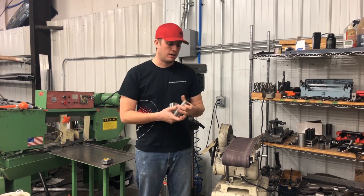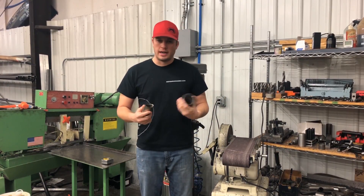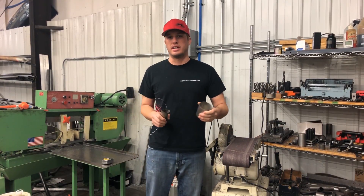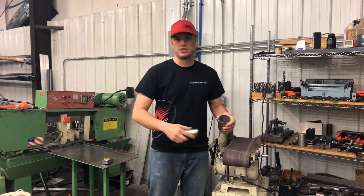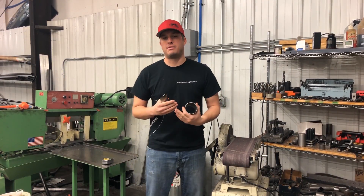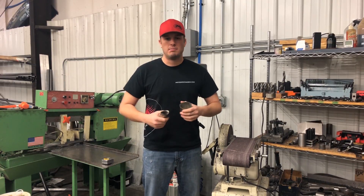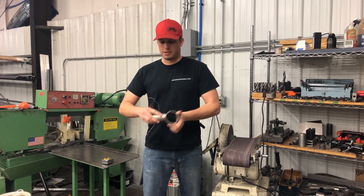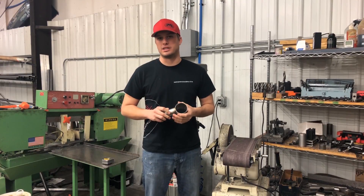The other part is the round part — it has a mandrel on the end, a roller. This one happens to be a three-inch roller at six inches wide. So if you're coming in to do a transition on a turbo pipe you can really lay a pipe over as much as you want. You're still going to have a lot of trial and error, but when you hit that angle you have a pipe where the fit-up is perfect. I don't care how good of a welder you are — if you don't have good fit-up, your weld is going to suck.